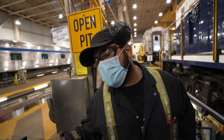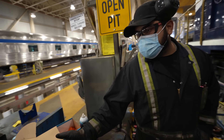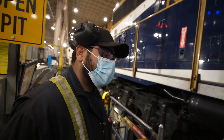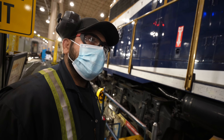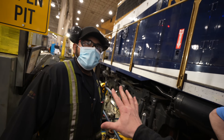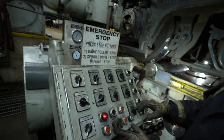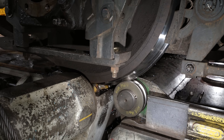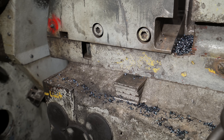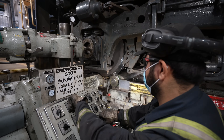They start at around 120, slowly cutting into the wheels until the wheel has a nice finish. These are the cutters — the shape of the cutter matches the contour of the wheel. A hydraulic motor turns the train wheel smoothly, then the cutter spins at high speed and cuts into the metal, sanding it down until the entire wheel is perfectly round again and the flat spot is gone. The operator watches and adjusts throughout the whole cut — it's an art.